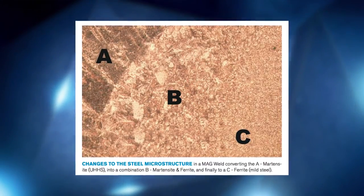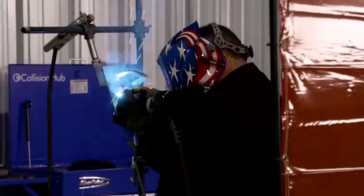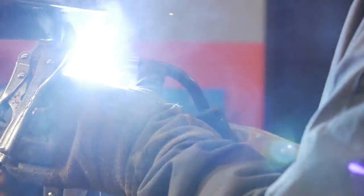The important aspect of setting up and testing the welder is that a lot of times in the industry, guys roll the welder over to the vehicle and start making a couple of welds — 'oh, it's welding cold' — then crank it up, weld a couple more — 'oh, it's welding hot' — then dial it in, but they've already welded half the vehicle before it's really dialed in. Now you've welded the vehicle back together with half the welds too cold, not penetrating enough, and the other half too hot, weakening the metal. If they would take the material they're cutting off the vehicle anyway, set up and test those welds, make the adjustment, then every weld on that car would be as proper as it should be.